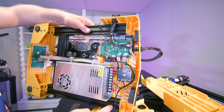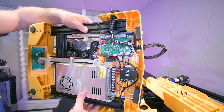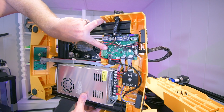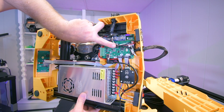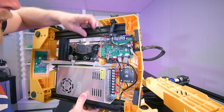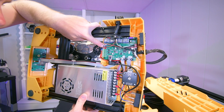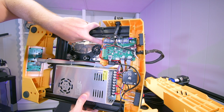Interesting how this cable runs over here. Nice quality plug for the USB. It's kind of like an extension cable. Looks like we have a UART port available right over here. That's useful. Also an LED port and something labeled reset. On the bottom there, I do see some kind of 3D printed part, and it looks like that's how all of the power or all the cable management is held.